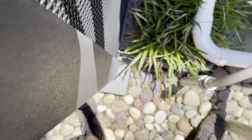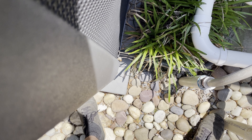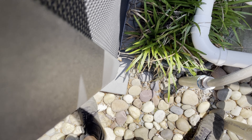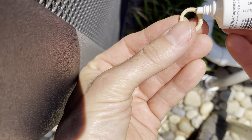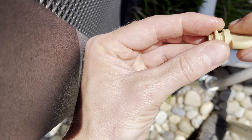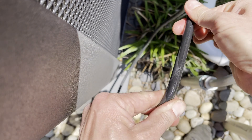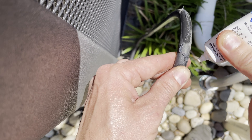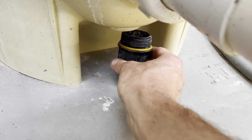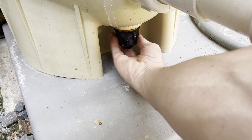There's also a rubber port in there. The next thing I like to do is look at all the rubber washers to make sure I have them for everything. There's one that goes on the bottom of the filter, one that goes around the filter, and the largest rubber gasket you'll usually find in the pumps. I go through and condition them with silicone grease to keep them supple and from cracking or drying out in the sun.